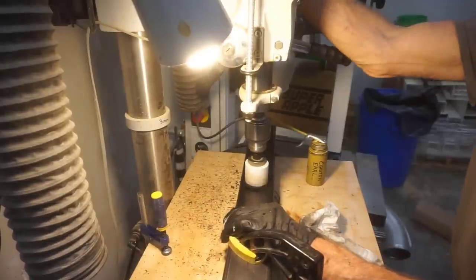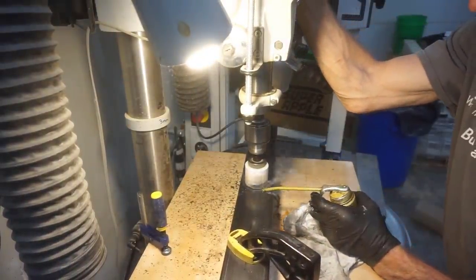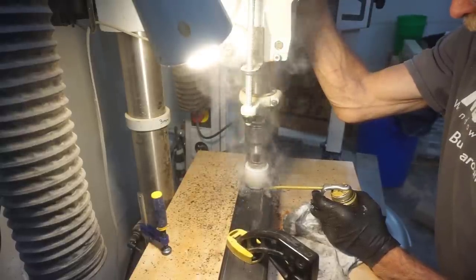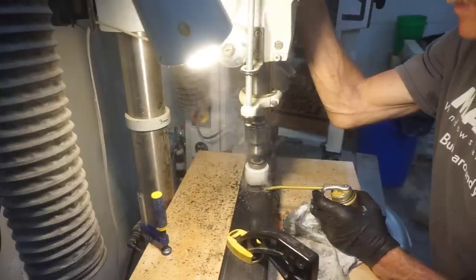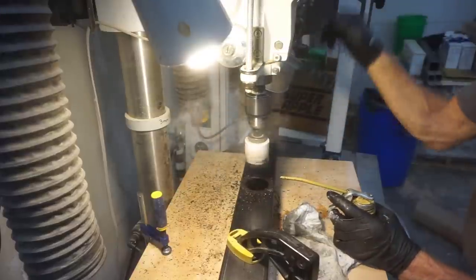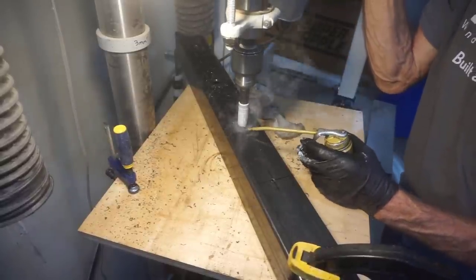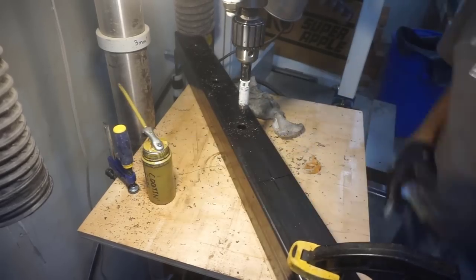With the hanger part complete, I start making the hangy part by drilling two inch holes in one face of a 32 inch long piece of three inch square steel tube. Even with a clamp, slow RPM, and a healthy dose of cutting oil, making this sizable hole is a little intimidating. I drill five holes like this, spaced for two lengths of six inch flex and four lengths of four inch flex. Flipping the square tube 90 degrees to the next face, I drill five holes three quarter inches in diameter in the adjacent face, aligning centers with the two inch holes.